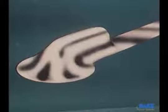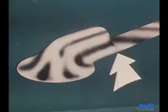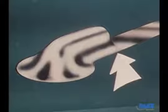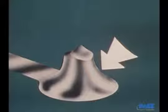With a clinched lead, the fillet should look like this, slightly concave and showing the shape of the underlying wire. The workpiece indicator here is the length of the solder flow along the conductor. An excessively long flow indicates too long a dwell time. With the straight-through leads, the preferred fillet looks like this. Again, the slight concavity and smooth, shiny surface.